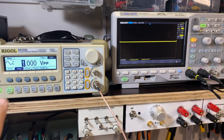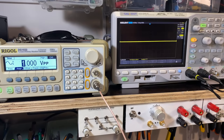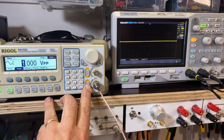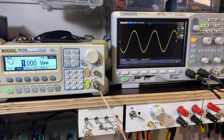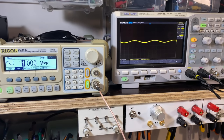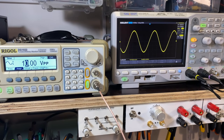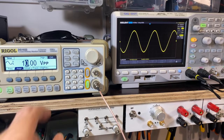We've got the signal generator set to 1 kilohertz, 1 volt peak to peak. I've got that going straight into the input. The output is connected to the scope on channel one. We've got times one — 1 volt peak to peak exactly. If I take this and make it divided by 10, a bit more noise creeps in. So let's set the amplitude to 10 volts — what do I get? 1.01 volts. That's perfect — divide by 10 is working perfectly. Let me put that back to 1 volt.